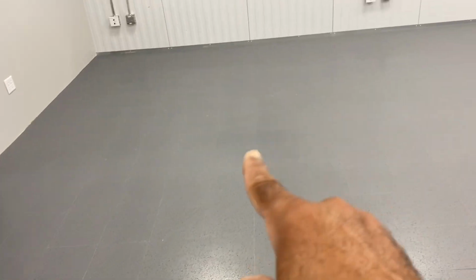Okay, guys, so we are finished washing these floors and they are dry properly. So now I'm about to put down the first coat of wax. You see some of these white spots there? They had some contractors in here, and these VCT floors have already been scratched up from the people that were working in here. They never covered the floors to protect them, so all of these little white spots you're seeing all over are all scratches already.